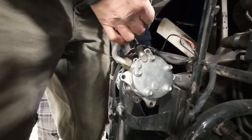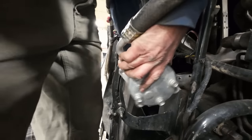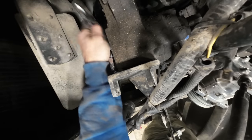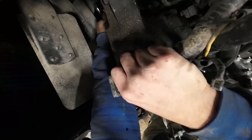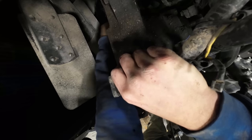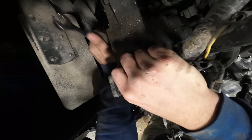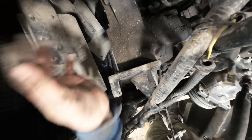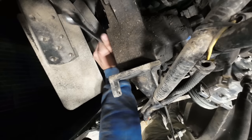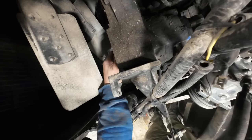Inside the cab, ready the heating lamp. Turn the fan. If it was on a belt, you could turn the fan and put the impact gun in different places and get them off. That fan is mechanically driven. See that fan's gonna, well, maybe not. Maybe that's gonna rub on the housing up there. It might have gotten tweaked a little bit. You might have to bend the top of that housing as maybe it was getting worked on.